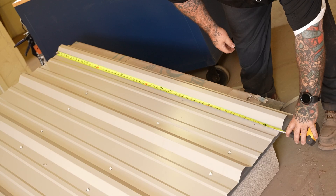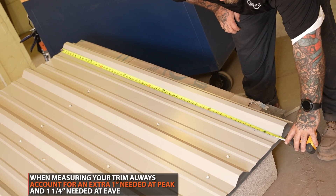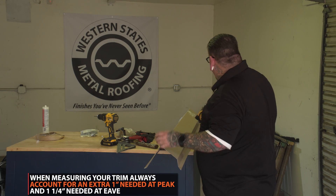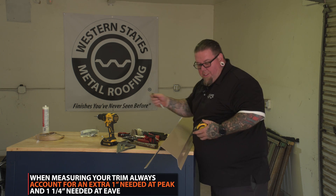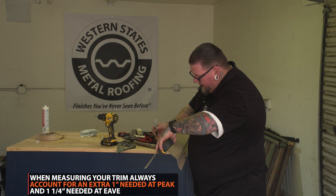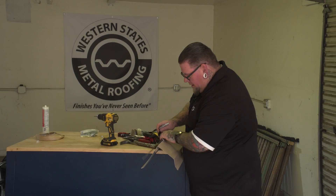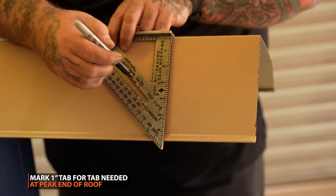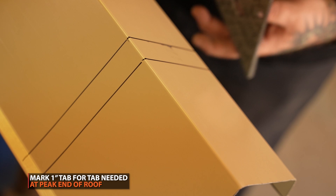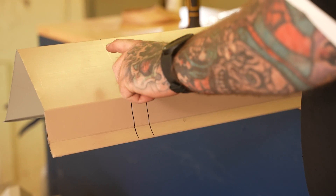Our workspace — we're going to measure our panels. Our panels are exactly 63 inches. I ran them three inches longer than the eave, but you don't want to go much more than that for rattling on your roof during high winds. So we have 63 inches. I'm going to measure off the front: 63 inches plus one inch tab, so 64 — one extra inch for the tab. This is the 63-inch line; this is our tab line.